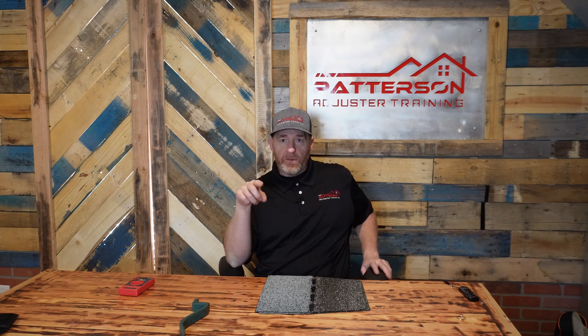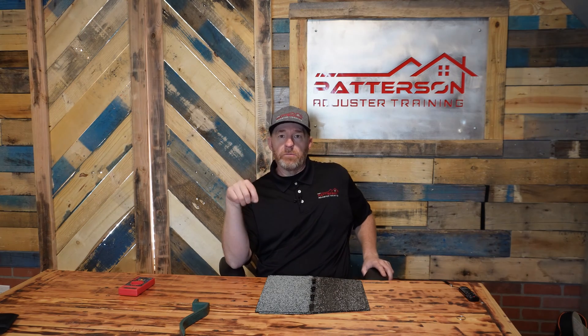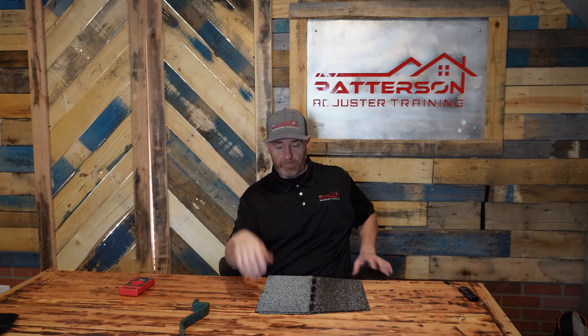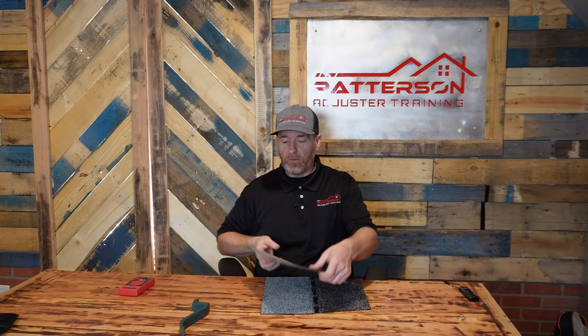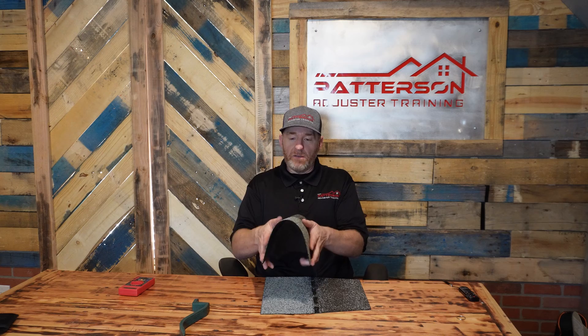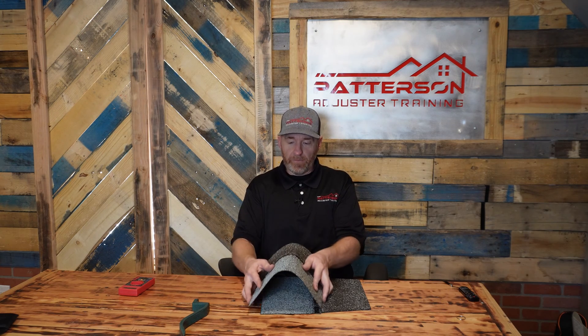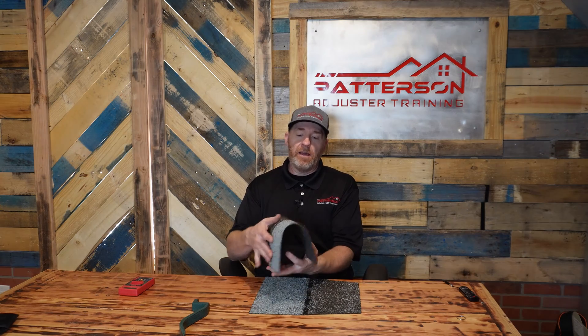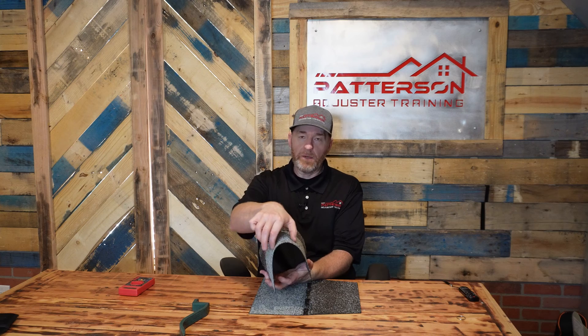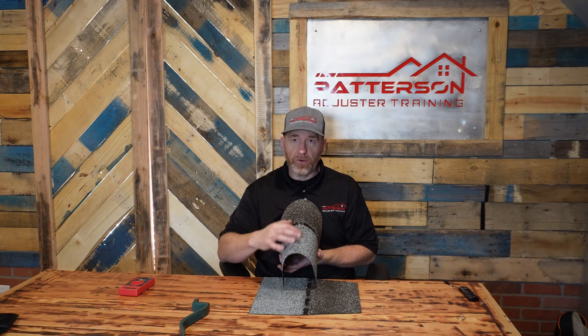In this video, I'm going to go out and try to replace some ridge shingles on this roof. Now, the ridge shingles are not repairable because I end up tearing them. What you've got on these ridge shingles, especially on a 12-12 pitch, is they're draped over the roof like this, and then they're fastened with nails on both sides. This fold right here puts these shingles in a lot of stress.